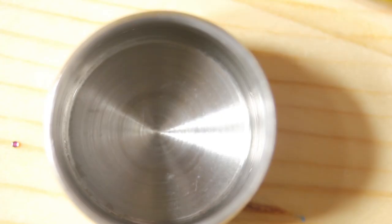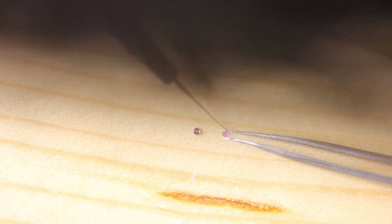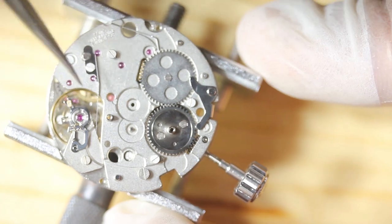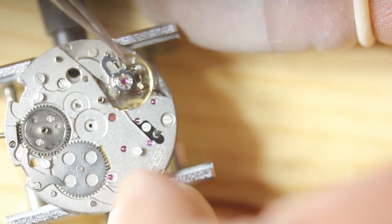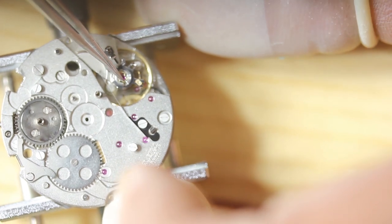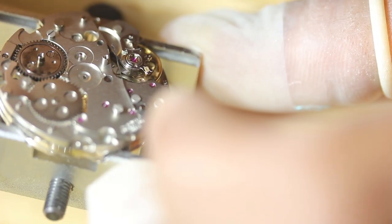and this will be cleaned with a special liquid called Zippo. I'm giving the ultrasonic effect to clean the jewel and the jewel cap. Now applying 9010. Now we can close the jewel cap with the jewel and it's installed in the balance. I'm closing the cover shock springs. Now we can clean up with the Rodico.